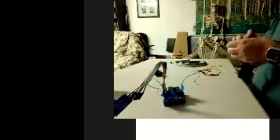And so now I'm gonna power this thing. I'll just unstick that. This is a 12 volt power supply and it's 7 volts more than this Arduino needs, but the Arduino Uno has a power regulator on it that will bring the voltage down to 5 volts. The problem is that it gets so hot you can fry an egg on it. It really shouldn't be that much voltage, but I won't run it for long.